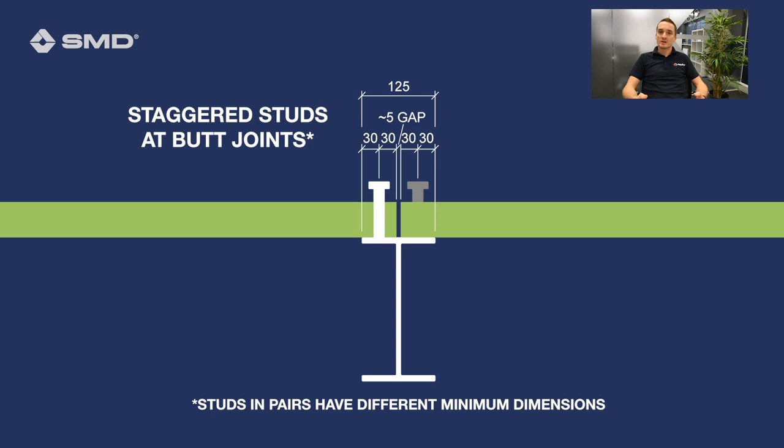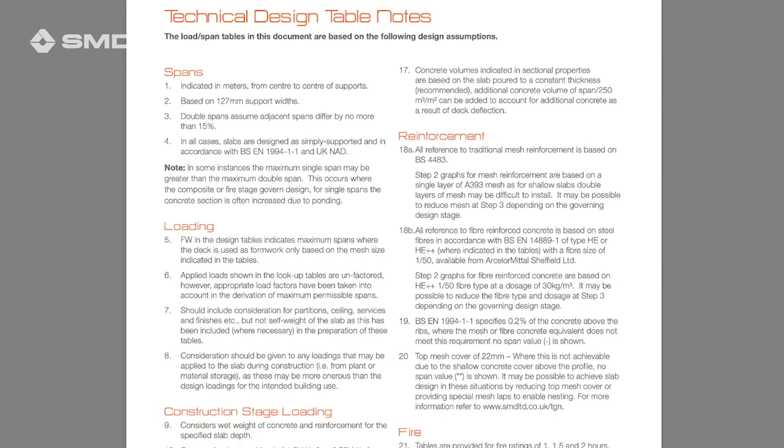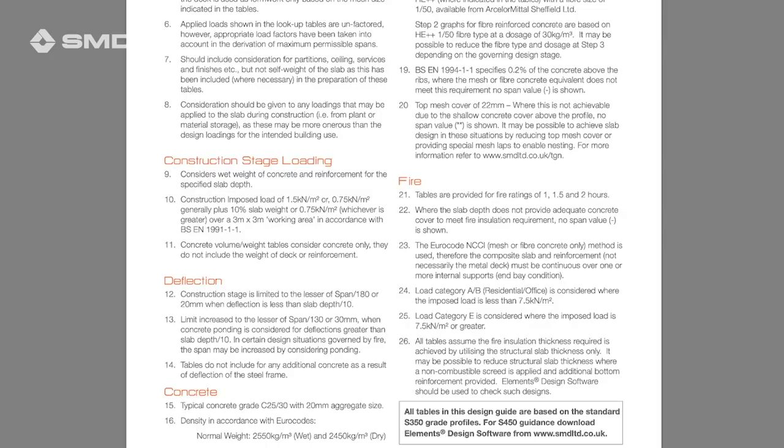The reason we've gone with the 127 millimetre wide beam support in our tables relates to composite steel beams with shear studs — there are minimum dimensions between those studs and between the studs and the edge of the beam, and you will be butting your sheets on that beam with butt joints. That's what's governing our tables as a worst case scenario. So if you're designing a build with composite steel beams where studs and concrete work together, 127 millimetres should be your minimum beam width. If you've got larger supports than 127 millimetres, those will result in bigger spans than shown in our load span tables — you'd then be better off using a design tool or software. Notably, not everyone bases their tables on 127 millimetre wide beams; some use wider beams, so you should exercise caution reading span tables and make sure you're aware of the design criteria upon which they're based.